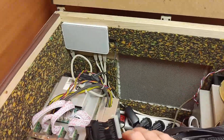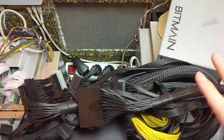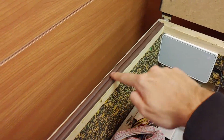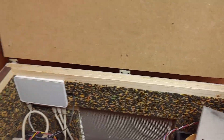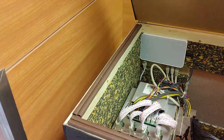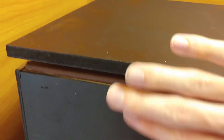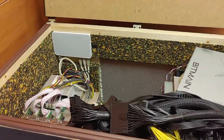There's also a little room for a switch so all the machines can be connected, and through a small cable hole the power wires go out the case — what we call a 'regleta' in Spanish, basically a power strip. I used one big main power supply for one of the machines but had to use two computer power supplies for another. I also put rubber sealing around the outside of the lid, but I made a mistake of not giving it enough space, so when I close it there's quite a gap and it doesn't seal well. I found it kind of helps actually, since it lets hot air from the power supplies dissipate, but if you want to do this properly make sure you take that into account.